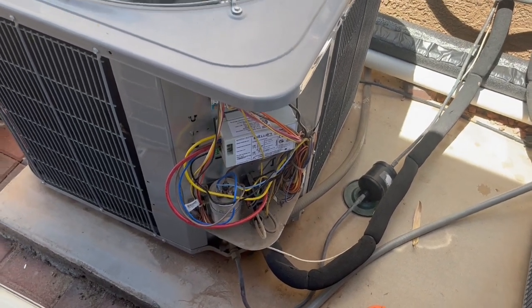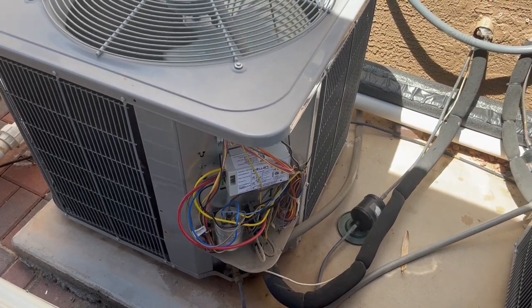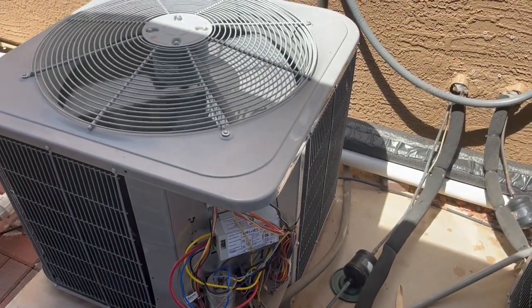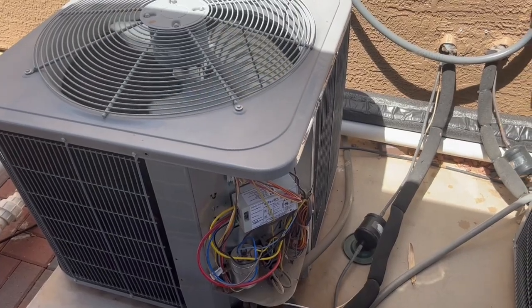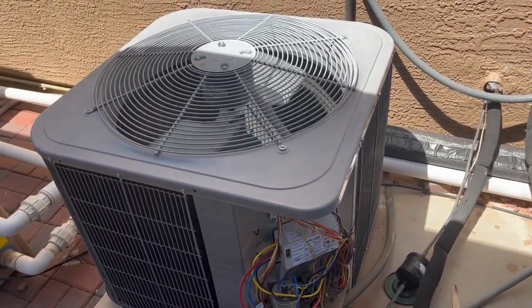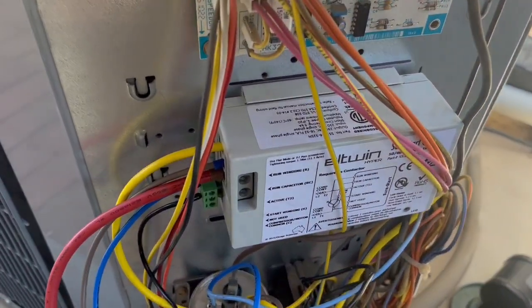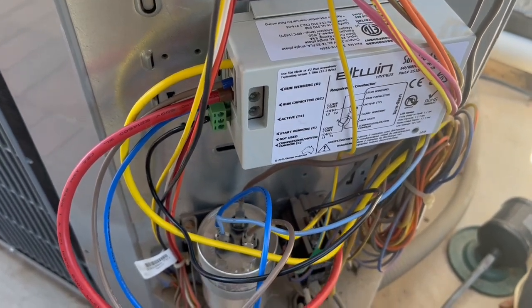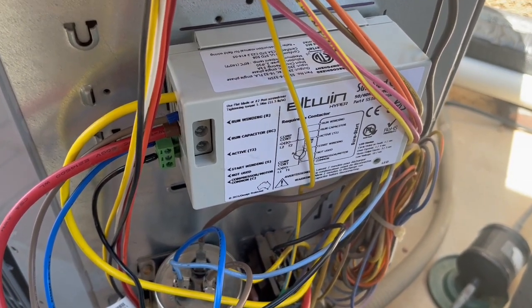So we were pulling 72 to 75 inrush amps when we were starting this thing up. And it's anywhere between 16 and 24 right now. This thing's been running for about 15 minutes. It's actually staying running, so it looks like it's all set. Now, this was $250 delivered to my door, and I just went online and Googled Hyper Engineering soft start, and it pulled it up.